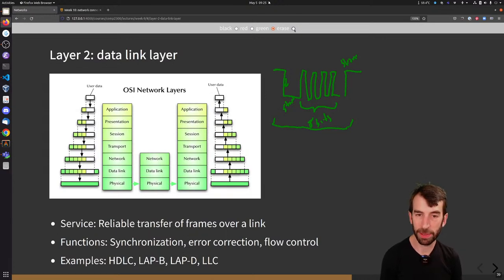Now there's a few things last week that I didn't tell you about because we didn't need them for MIDI. But there can also be an extra bit here, and the extra bit is called the parity bit. And what's this? This number is going to be 10101010. 1, 2, 3, 4. So our parity bit, there's our stop bit. Our parity bit is going to be determined by counting the number of ones in the byte we're sending. In this case, it's 4 ones.